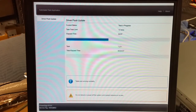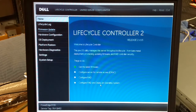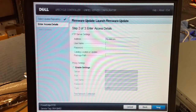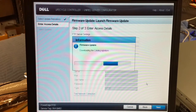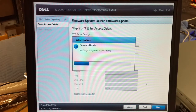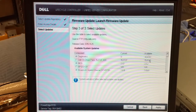Now passing through the five minute mark. Completed at about five and a half minutes. Go back into firmware update, launch firmware update, back to the FTP site. We want to verify the update completed properly. We can see that version 15.07.07 matches what's on the website, so we know we're up to date and have loaded it.